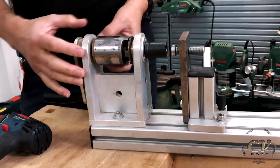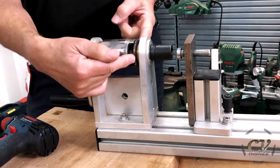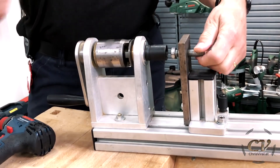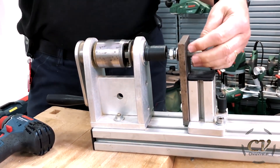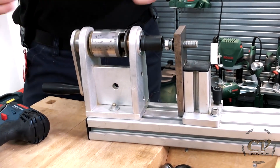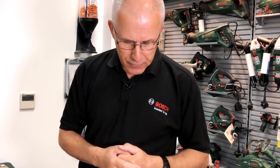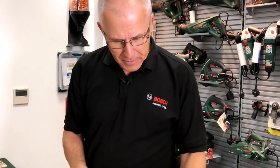You can guess how they work. This is the hammer and that's the anvil that the hammer hits. When there's no resistance to driving a screw — maybe you're driving a screw into soft wood — impact drivers and cordless impact wrenches have a very high rotational speed, which is fantastic. They really do run fairly long screws in quite quickly, until the material puts up a fight. It starts to put the brakes on and becomes resistant to the screw being driven in. And then this mechanism comes into its own.